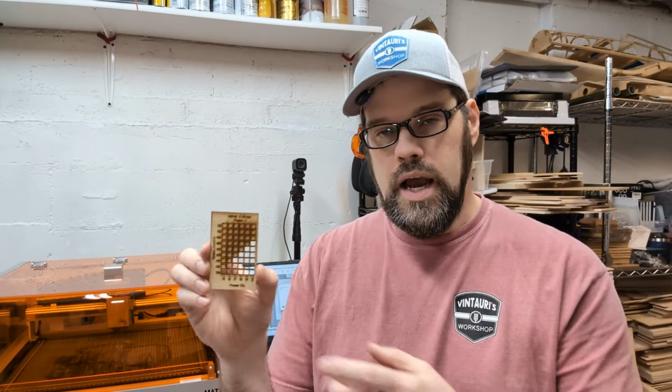Again, different material is going to have different settings, which is why you want to run it on that. But in reality, you're going to run into some pockets of glue, maybe air voids, things like that. So I like to back it off a little bit. And you might not want to run your laser at 100% power for various reasons. So you might want to look at something in the 80 to 90% range and identify speed there.